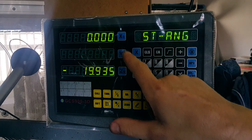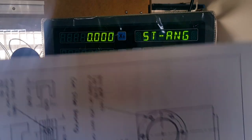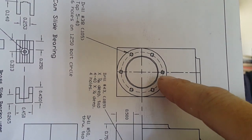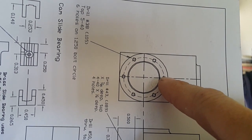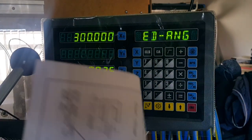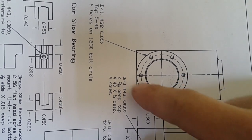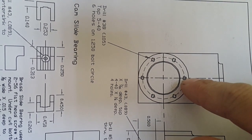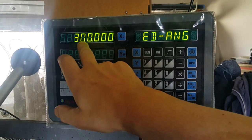It's now asking us for a start angle. We want to be starting at zero — looking at the paperwork, the cylinder block is sitting in the milling machine and we want to start on this hole here, moving from the center and coming out this way to our first hole, so that's at zero degrees. Then it's asking for an end angle — our last hole is at 300 degrees. We don't want to go to a full circle otherwise it will put the last hole back on top of the first hole. So we go one, two, three, four, five, six and finish — that's 300 degrees for our last hole.